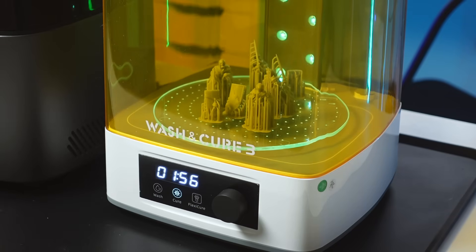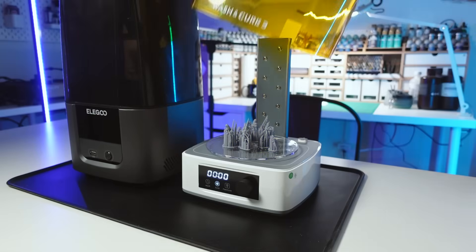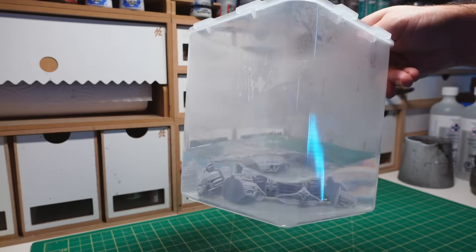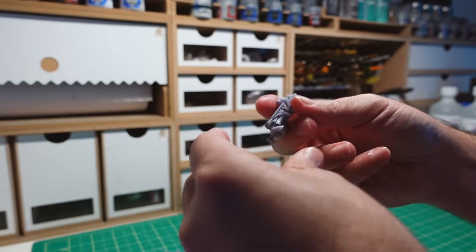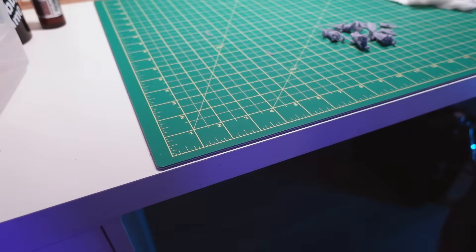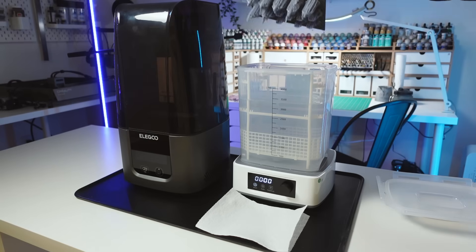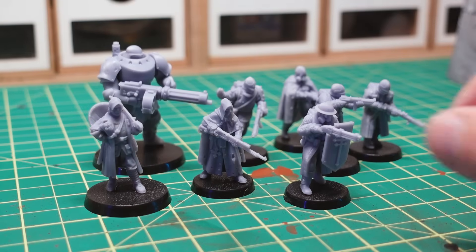That being said, an alternative and a preferred process of mine would be to cure the miniatures before removing the supports. The benefit of doing this is entirely avoiding having to touch the uncured miniature and being able to use your bare hands for more fidelity when removing the supports. If you choose to go this route, make sure to place the cured miniatures in a dedicated container of hot water to soften up the plastic before removing the supports — this will almost negate the difference of removing the supports after they've been hardened. Another bonus benefit to this method is being able to dispose of all the support waste in your regular garbage. With this process, you'll be able to print miniatures without getting a single drop of resin on your gloves. Honestly, if there's any one takeaway from this video, it's that the post-processing part of resin printing can be much cleaner than what is commonly seen online. Having a clean and efficient print process makes resin 3D printing much more enjoyable, which also results in me printing over and over again.